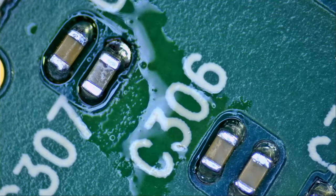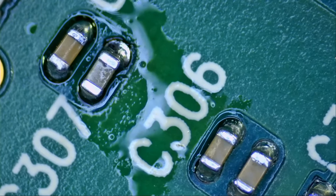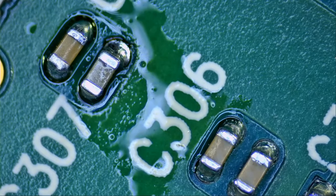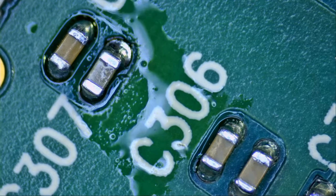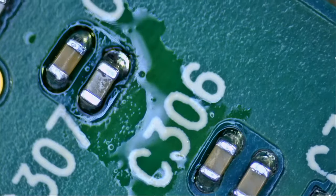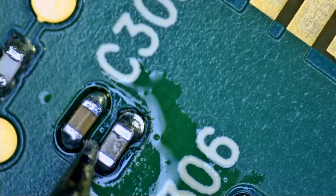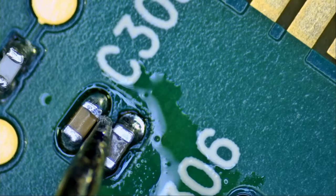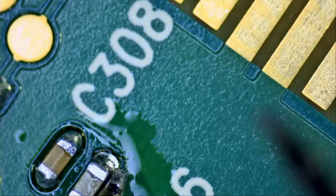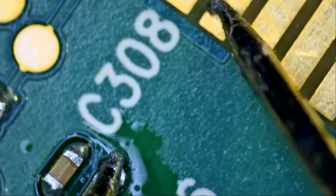Okay, very nice. Now we're gonna measure. The bottom pad was already there. We did not replace it, but we're gonna measure anyway in diode mode. We have a connection and we're gonna measure from the bottom here, or from the top as I have the board oriented, to one of the pads, to one of the lines on the card down here. Which one is it?